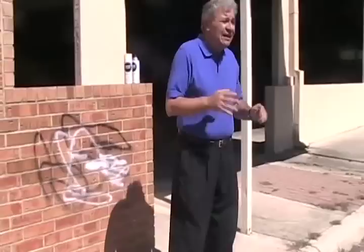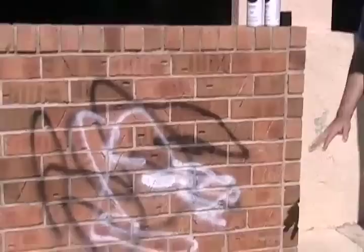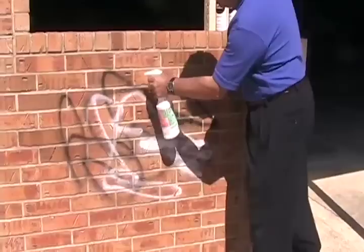Here in Texas, a lot of limestone is used. The limestone is very soft and very sensitive. But now I'm going to remove the graffiti with our sacrificial coating — it makes it much easier. We always spray from the bottom when applying the coating. When you're going to clean it, you start at the top so the residue doesn't trickle down.